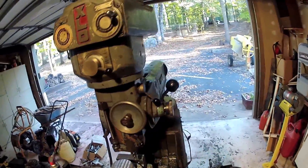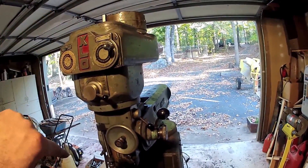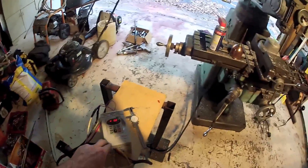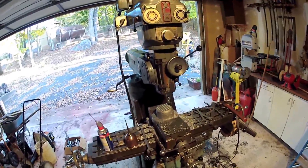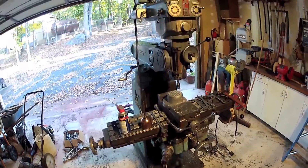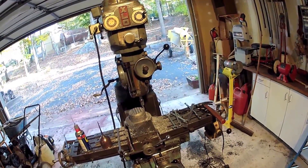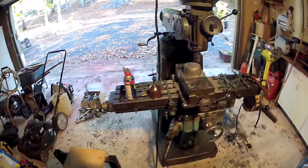The reason for that is when this motor starts to coast, it becomes a generator and that power has got to go somewhere. There's a way to hook up a resistive brake and actually force the motor to slow down, but that power has to be dumped somewhere. If it's dumped back into your household current, it can cause problems for other pieces of machinery like your refrigerator — or the power company can get upset with you apparently.